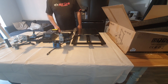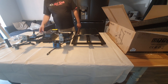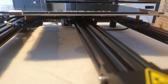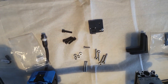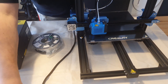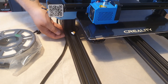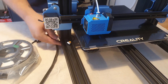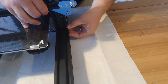I've got most of the issues sorted out — the heated bed is now attached to the bottom frame with the little yellow springs. I've laid everything out so I can see what's going on. The springs are attached, the leveling wheels are on. We're going to use the little black screws to attach the top frame, and it's literally just a case of making sure the cables are out of the way, lining it up, and slotting them in from underneath. It's a little bit fiddly — might be best to turn it on its side or move it over the edge of a table so you can actually see what you're doing.